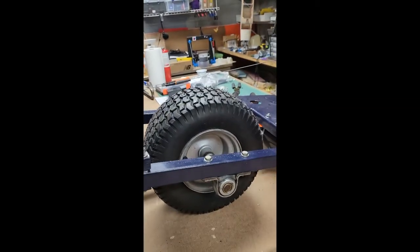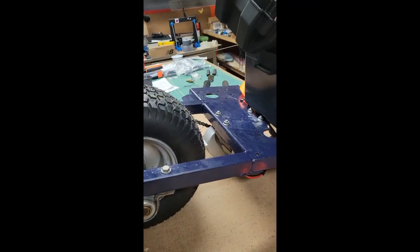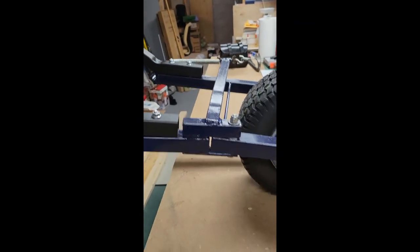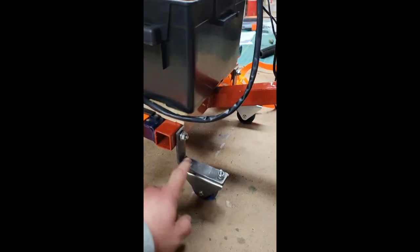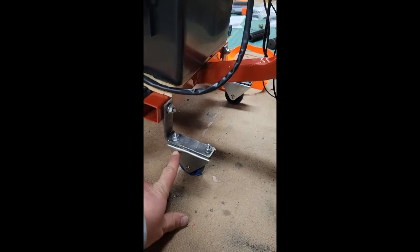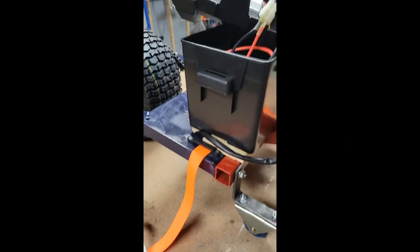My son helped me — it was a bit of an arm-wrestle — but with some soap and water we popped the tire onto the rim and got the new valve stem in. The frame was wire-wheeled with a drill — remember, use a drill, not a die grinder, as wire wheels aren't rated for high RPM and can go in your eye. I used acetone to clean off 40 years of grease and grime, then used a torch to reheat the feet and re-bent them into shape. Picked up rigid casters from Harbor Freight; they're holding up well with tension, and I may add a star washer if needed. These are just to tip it up and move it quicker.